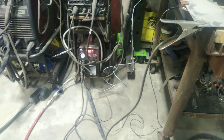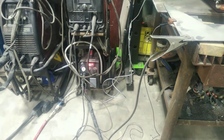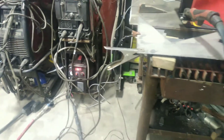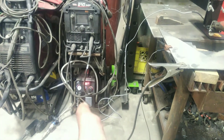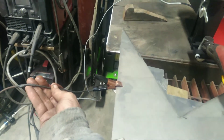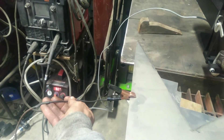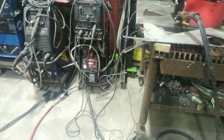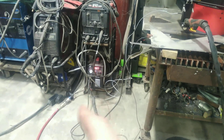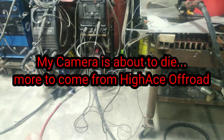I had his lead-in a little too long — that should have been shorter. I learned a lot from this. We're going to take it home, work on the drawing a little bit, change it around, and learn from it. But we got her working — the Arc Droid is officially cutting! I'm running it off one of those cheap Amazon deals, the Lotus non-pilot arc. We converted it so that it had pilot arc — that's what this brown cable here is. This brown wire tricks it into thinking it's just been touched down to the steel and it lights up. I'll do a video on that — this works for most CNCs and most non-pilot arc machines.